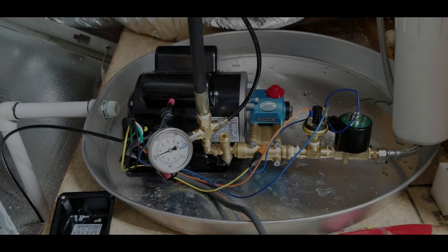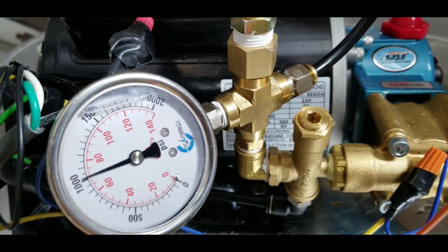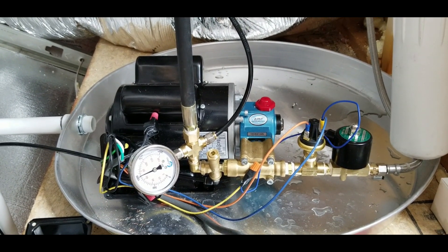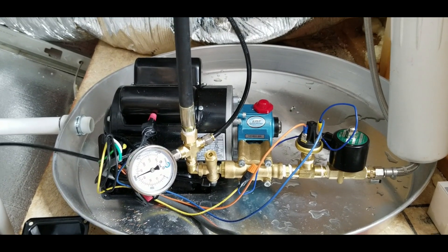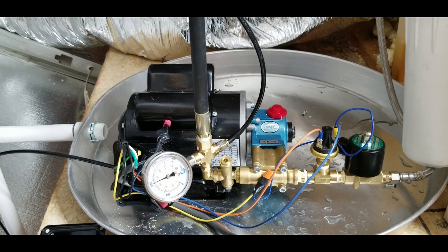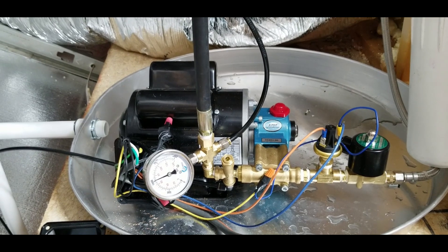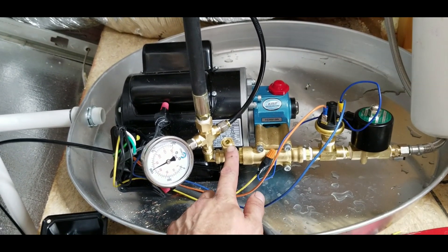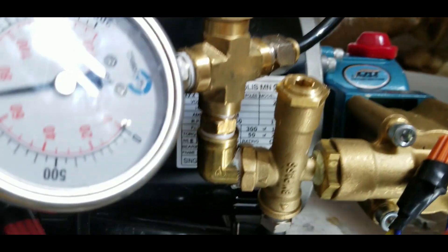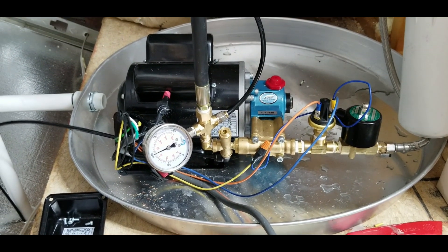The unit running isn't very loud — you can hear me talking over it. It sounds like a little motor running, like a bench grinder with no wheels. There's a slight vibration from the pump. It's a little louder than a hydro fogger, but the noise is more vibration than anything. You can see it's pumping out 1000 PSI. To adjust the pressure, just back off the lock nut and use an Allen key to screw the regulator in or out — it doesn't take much.